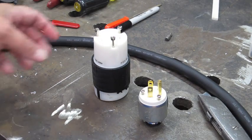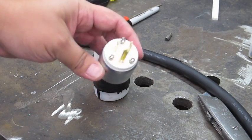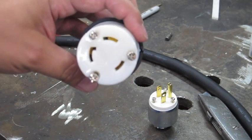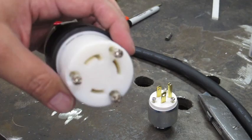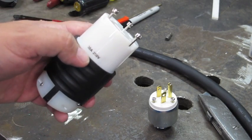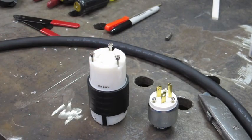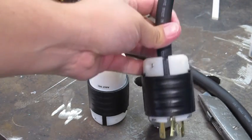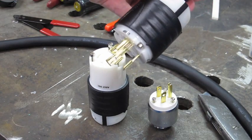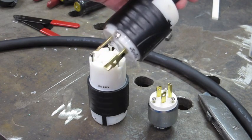The next two items we'll need are the two plugs. This plug here is a standard 110/120 volt — it's actually a 15 amp plug. The next piece is this female twist lock connector, purchased at a big box store. It is a 30 amp 250 volt, and the reason I chose that is because the actual plug in the machine is also a 30 amp 250 volt. Here it is — this is the actual male plug connected directly to the Miller 200DX — so we need to use a female twist lock that's going to mate with it properly.